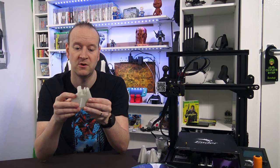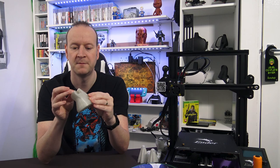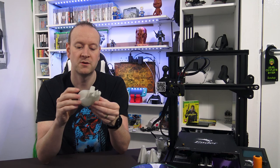I have actually swapped to a brand new 0.4mm nozzle. This worn one will get shoved to one side. I have got some hardened steel ones on order — they'll be arriving shortly, and I'll use those going forward to print glow-in-the-dark filament. Going forward, I would recommend using a hardened steel nozzle. If you've got plenty of brass ones to spare and can afford to chuck them away, by all means continue using brass. But if it's something you're going to be printing with for a very long time, I would recommend hardened steel. If you enjoyed the video or found it useful, please smack the thumbs up or down, subscribe to the channel, ring the bell — it helps me out immensely. Drop any comments below and I'll do my best to answer. Until next time, happy printing!